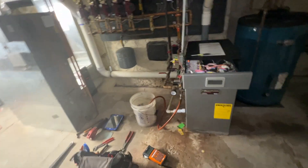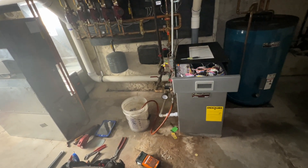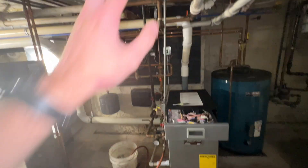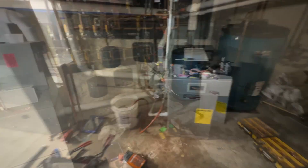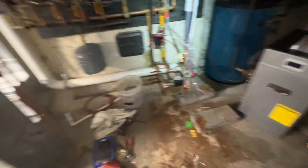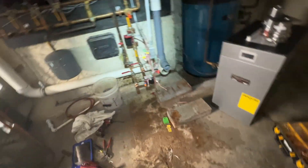Peter's not going to be here for an hour, so I'm just going to get everything disassembled while we wait for him. It's a pretty straightforward replacement. I tested the switching relay, and it seems that all the pumps are working — they were all circulating, so we should be okay on that. You can see the boiler is moved over, we're completely disconnected. I prepped my one-inch couplings here. I'm not sure we're going to line up exactly on the new unit because it does look like it might be a bit different on the new model. I marked insertion depth on both, because you have to do that with Viega in order for them to warranty any fittings.